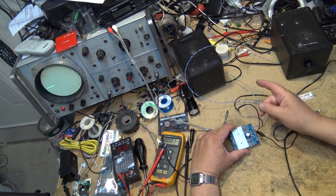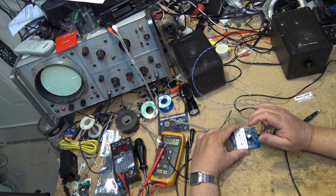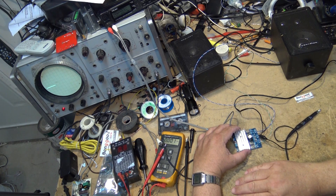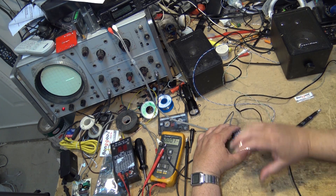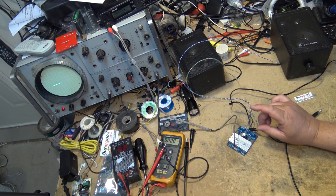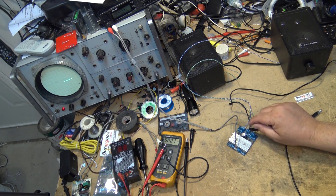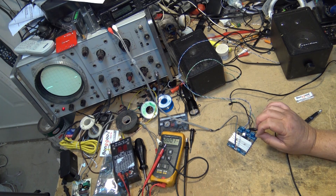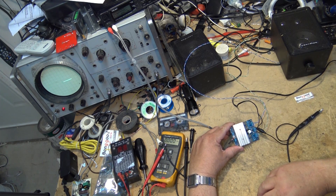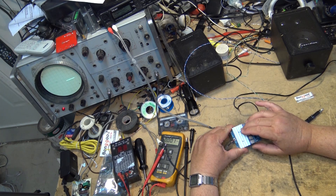It's basically just two MOSFET switches switching back and forth, on or off, working into a perfect load — the inductors. Unlike a conventional linear amplifier where your transistor is varying from no conduction to full conduction, when a transistor is in its linear state it's acting like a resistor that changes its value dependent on the signal at the base, and the excess current is dissipated as heat. On an analog amplifier you require massive heat sinks to dissipate that generated heat.